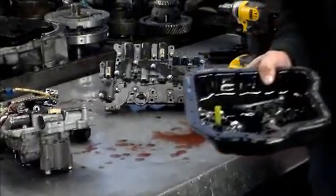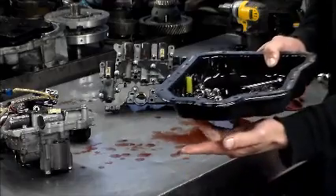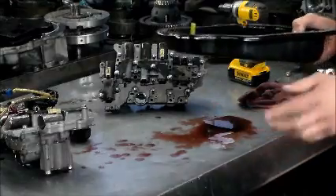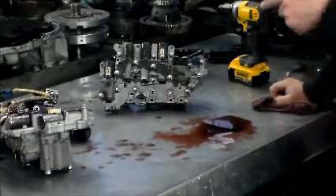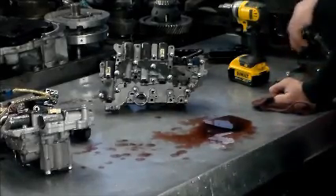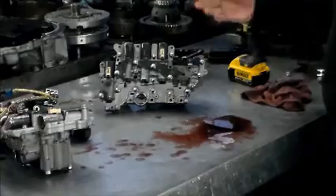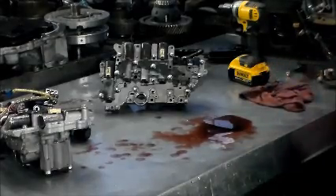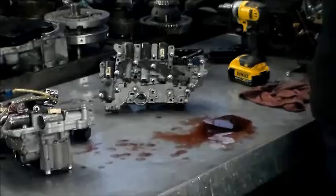Real quick, here is the pan. You can see there's a standpipe in the pan. The way you've got to fill this thing is you pull the plug out of the bottom. In the back cover by the left wheel is actually where the fill is. You fill it until it comes out of the top of the pipe, then you start it and fill it again — just like filling a typical transmission with no dipstick. They call for WS fluid. I actually have a fully synthetic fluid that is compatible with the WS fluid — I buy that in five-gallon buckets. It's made like a CAM2 fully synthetic oil, very good oil.